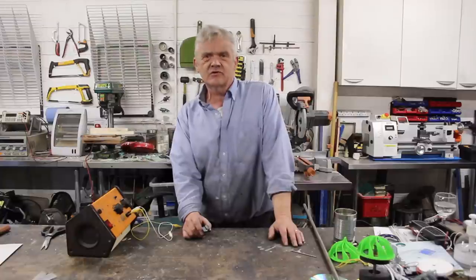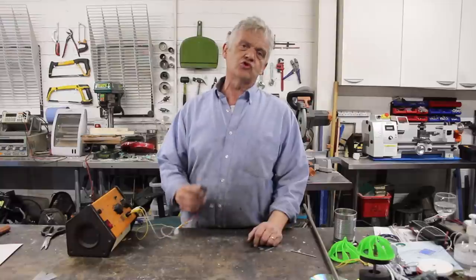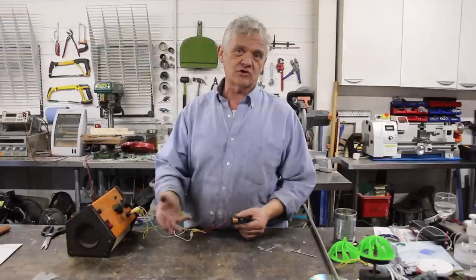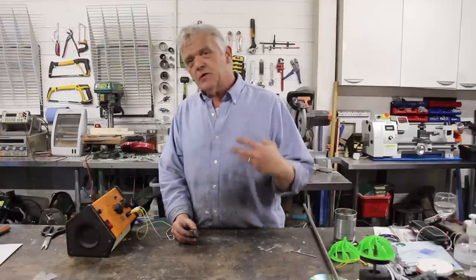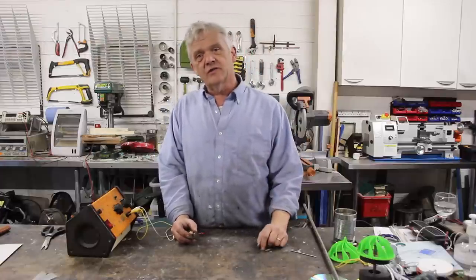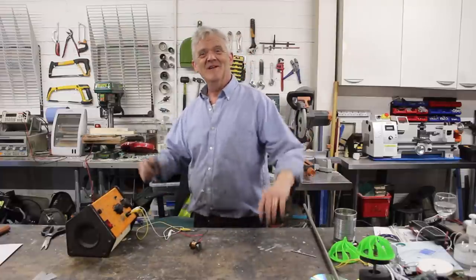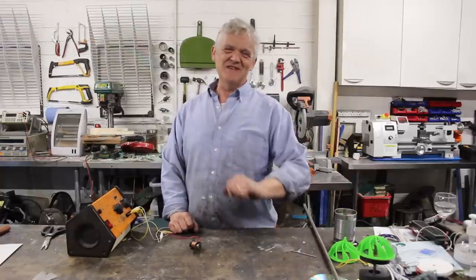The best deflection I believe they've achieved is around two centimeters with a strip of phosphor bronze, so I'm quite happy with that. That's about all there is to solid state fans — you need something that will vibrate, and you need to make sure it vibrates at the frequency you're going to input. Plug it straight to the mains and that's 50 or 60 Hz; use a different frequency and your length will change, depending on the material. You can calculate those frequencies or look up online calculators. You need an actuator at the bottom — a piezo element, or I used induction with the sound bug — clamp it down one end so it's a clamped bar, and you've got yourself a solid state fan. I hope you enjoyed the video, thank you very much for watching, and please do remember to like and subscribe.